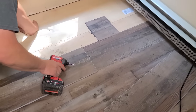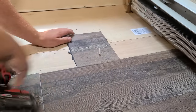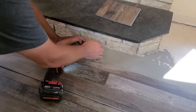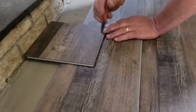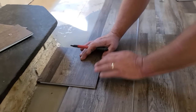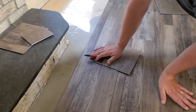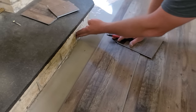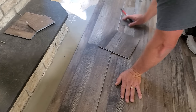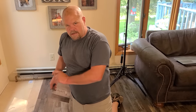Everything is done and we're ready to start taking out the scrap pieces we used to secure the floor. Because this is vinyl plank, I can get away with a small gap near the fireplace and either use matching caulk, matching silicone to the plank, or matching silicone to the brick to fill that gap. I could also put quarter round around the fireplace since the brick is pretty flat. If you have stone, you can't do that. Another option is to run a decorative rope around the gap and paint it — a rope found at the hardware store can hide that gap.